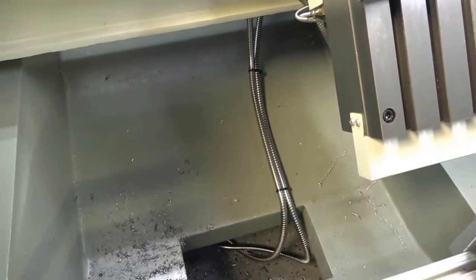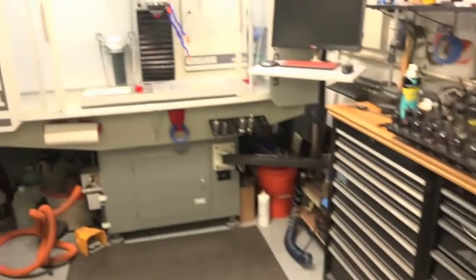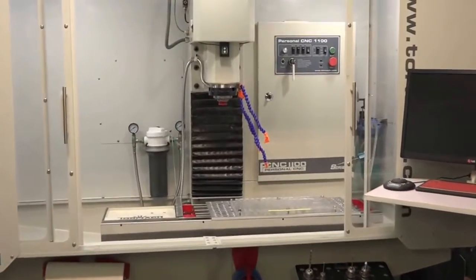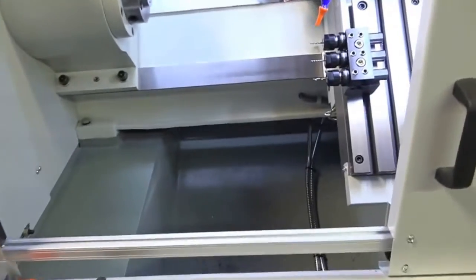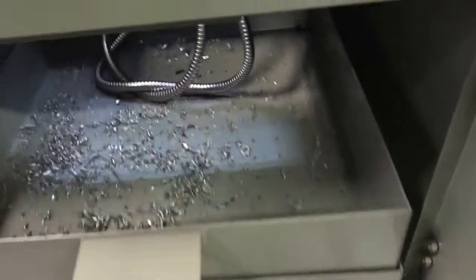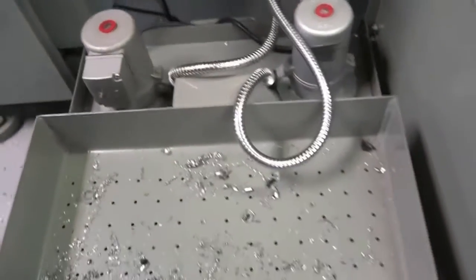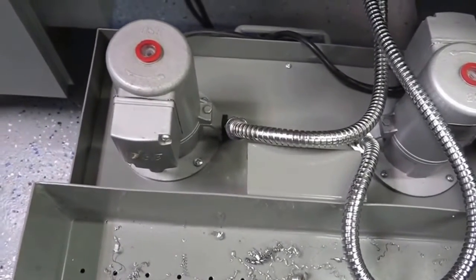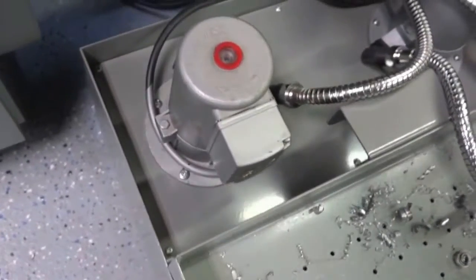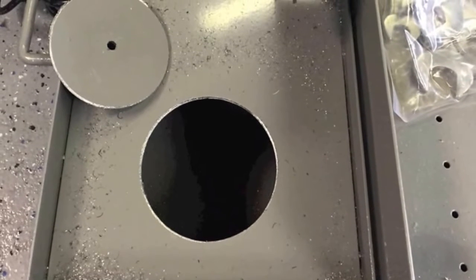You can see I got two individual lines. What I did was upgrade the pump from my Tormach mill — I had it kicking around — and added it here. I just drilled a three and a half inch hole with a hole saw and four individual holes to screw the pump in, as you can see in these pictures shown.